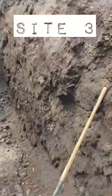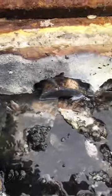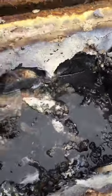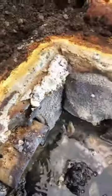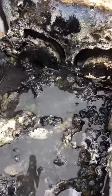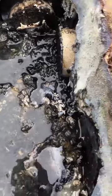After some excavation, this distribution box was dug out and we separated it. You can see the flow — there's a lot of solid buildup in here, pretty nasty. You can see the water flowing from the septic tank and short-circuiting directly into one line, while the other lines are completely plugged.